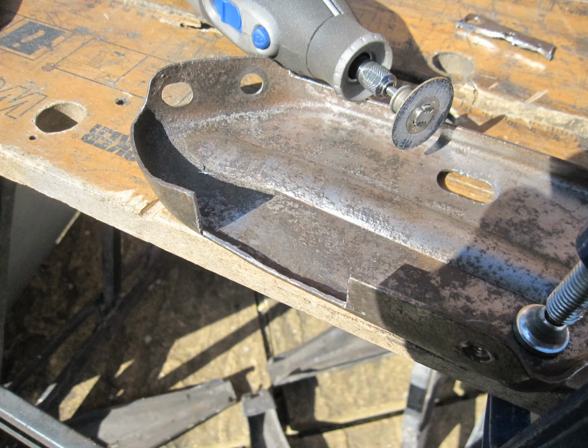Here's the repair from the outside of the panel. It's gone well, so not that easy to see. It's just inside this triangle. Now I've moved on to the other bracket and the holes in the top face here. The metal isn't brilliant in this area, so I've cut away a biggish piece that has the worst rust damage.